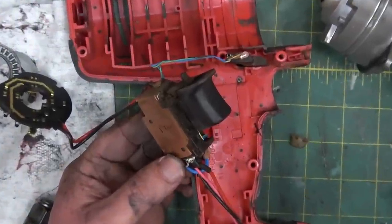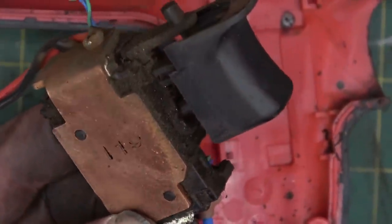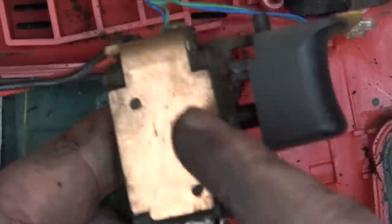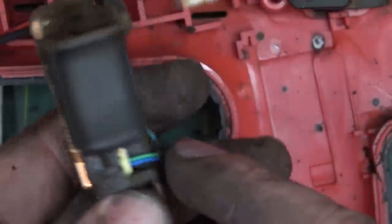Comm bars are going to get dirty because they're up against the graphite — the graphite smears off, it's a conductive layer and it's also lubricious. But I think what happened was she got too hot, oxidized. The graphite sublimates and some of the adulterants get left behind — maybe some iron oxide powder or just regular schmoo in the air — and that contributes to a high resistance connection. So I'm going to clean up these brushes as best I can, just scuff them up a little, give them a new bite. Now, the brake after we get this all shimmed up — the switch. See why you want a bellows on that actuator rod — right full of toxic schmoo, and that's conductive dust. In here, because it's a speed controller with a MOSFET, there are clearly some active components because of the heat sinking. You don't want conductive dust on your PCBs.